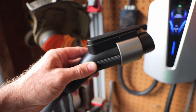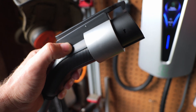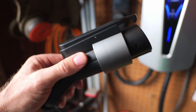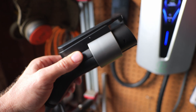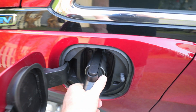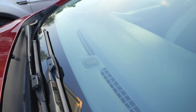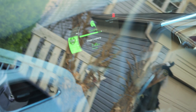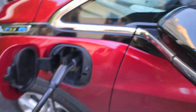This is AC — basically what it uses is your car's AC to DC converter to charge your car, so you're limited to how fast that converter on your vehicle is. You can see mine does not have the fast charge, which is okay — I don't really need that and it's better for the battery anyway. This charger is pretty darn fast. I already charged it last night, drove around a whole bunch today, and you can see the car pretty much acts like your phone when it's charging — it'll tell you exactly how long it's going to take, and at 7:45 tonight, which is already about 6 o'clock, it'll be charged. Does not take long at all when you're not very low.